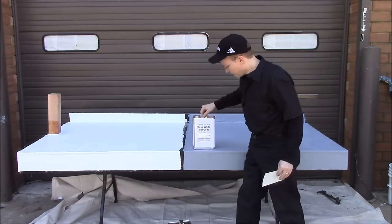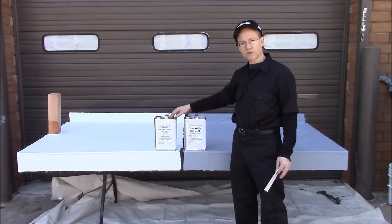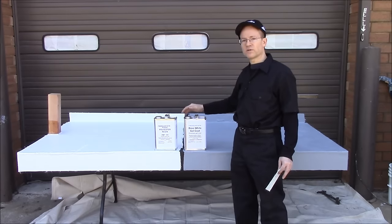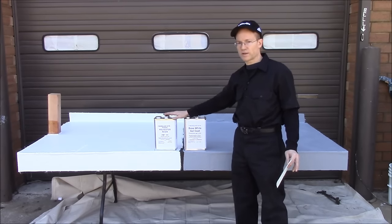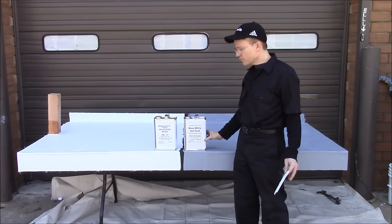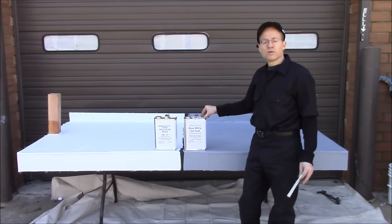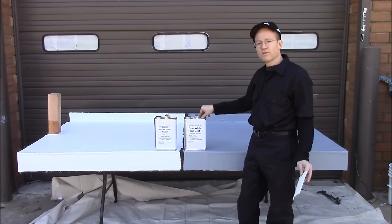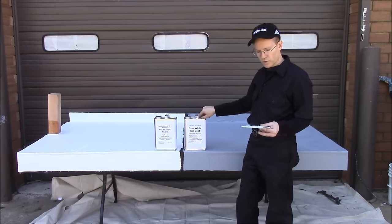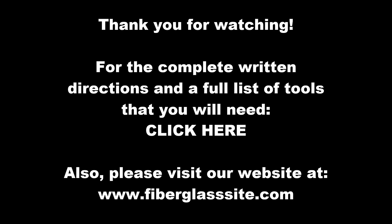Let me go over what we did very quickly and what our ingredients were. The three ingredients we used were two-ounce chop strand mat, unwaxed polyester resin, and unwaxed gel coat. Use hardener every time you mix your polyester resin and every time you mix your gel coat — never use these resins or gel coats without hardener. The only time you use wax is in the very final coat of gel coat. You put the wax in, it rises to the surface, and you get that very, very hard finish. If you email the square footage of your deck to fiberglasssite.com along with your city and zip code, they will do a workup for you. It's going to be between $2.75 and $3.00 a square foot, including the gel coat and delivery. Thank you.